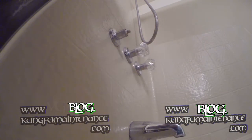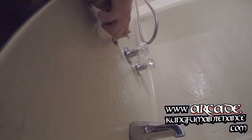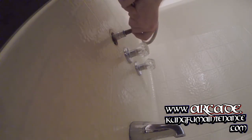It might be a good idea to plug the drain to keep from losing the screw. Got my handle and the screw in there. Spin off the escutcheon, take off the extension. I like to pre-loosen my cartridge a little bit once I get it off, just to kind of verify that everything's going to fit up before turning the water off. Don't loosen it too much — just enough to make sure the socket's not going to slip.